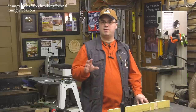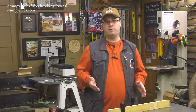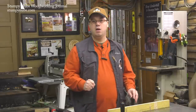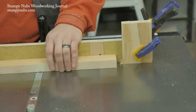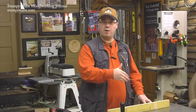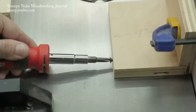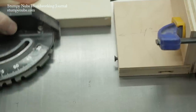I can't stress enough that you should never use your miter gauge to make a cut all the way through a workpiece while the end of the board is against your saw's fence. If you do use a stop block, watch out for dust buildup that can prevent your next workpiece from fully seating against it — either blow it away between cuts or cut a chamfer on the block so the dust has somewhere to go. And one final tip: you can add a screw to a stop block to create a micro adjuster to fine-tune any cut.